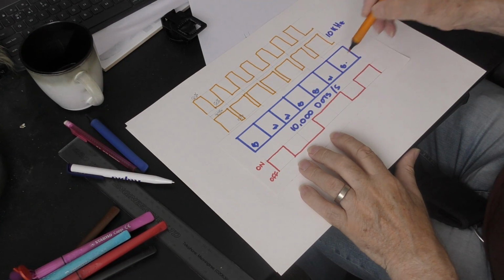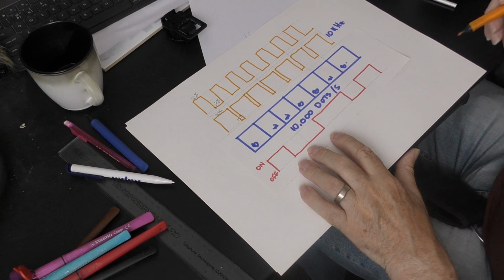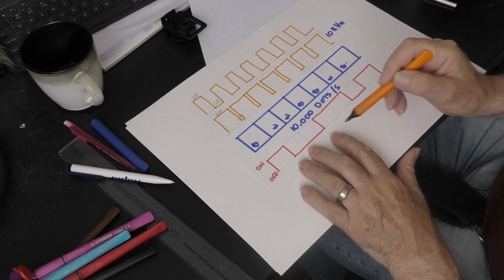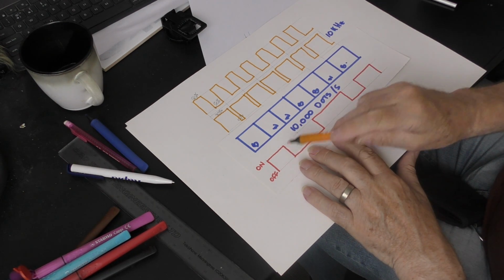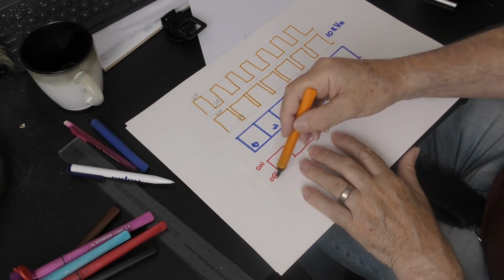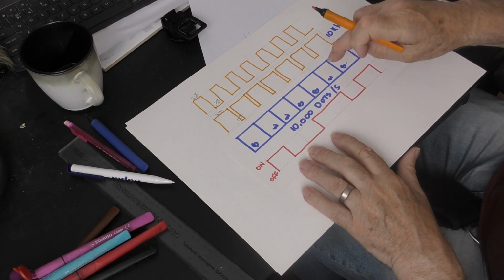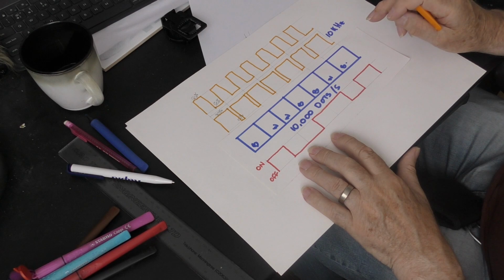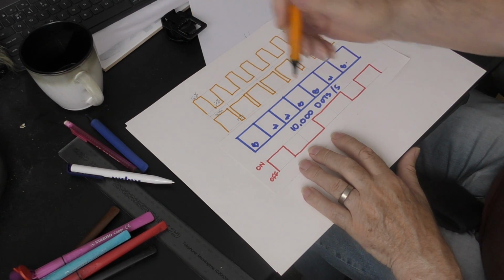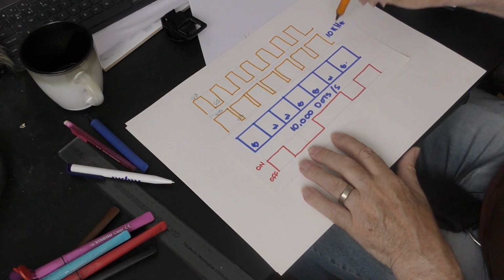Here's our pixel string. We've got a black pixel, white, white, black, white, and black. Okay, so here's what the controller will say to the laser tube: on, off, off, on, off, on. That's the signal that will be required to turn the laser tube on to print these pixels. And here we've got our matching 10 kilohertz signal. This is 10,000 dots per second, and this is 10,000 pulses per second.